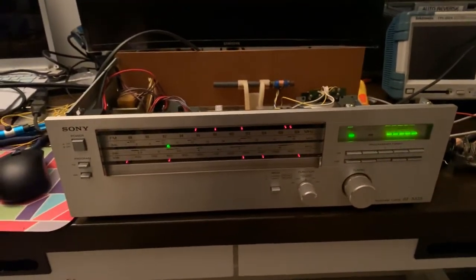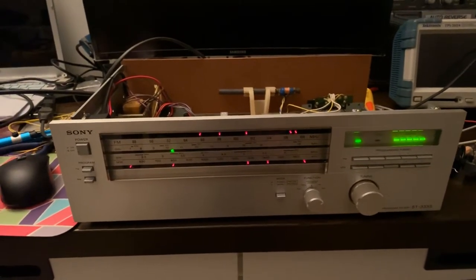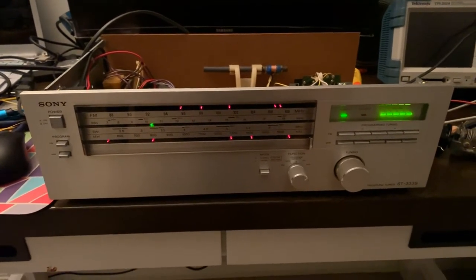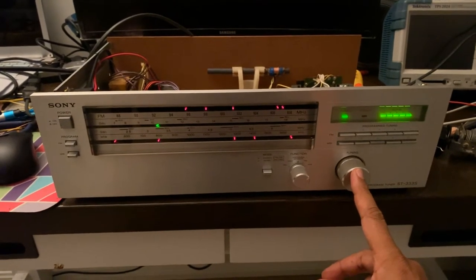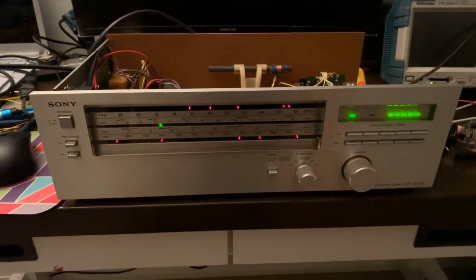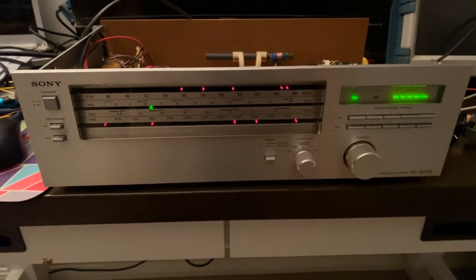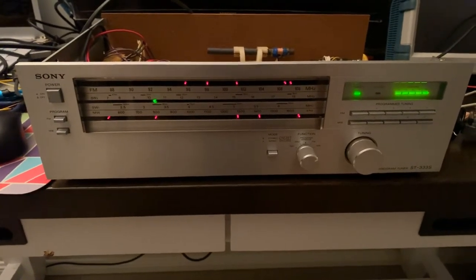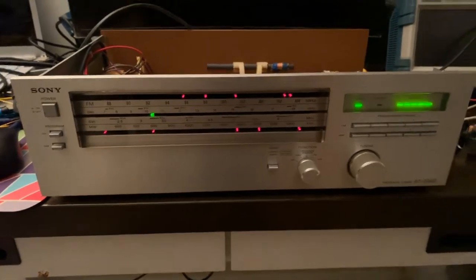Here's the beauty of this — this radio has no tuning capacitor, but it's got a lot of varactors, which is a variable diode, and the whole radio works off variable capacitance diodes. When you turn this knob you're turning a resistor, and when you set the presets you're picking different resistances which give different voltages to the RF. I wanted the big capacitor to strip and it's not there, so it lives another day.